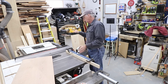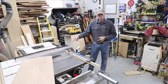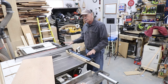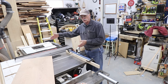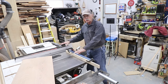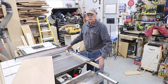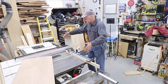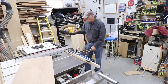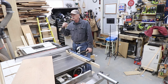The process I've decided on is not with the router and a jig, although it worked last time on smaller projects. On the table saw with the dado stack. The way it works is I'm going to take the work piece, set the depth from the fence — I've got a new drawing with the correct dimensions — to where I want the dado to be, and then run it across. Bring the second piece over, run it across, and those dados are going to be in the same place. I have my miter gauge and a roller for when I'm way over here, but as I move the work piece further down the saw I can just run it against the fence by hand. Cue the timelapse.